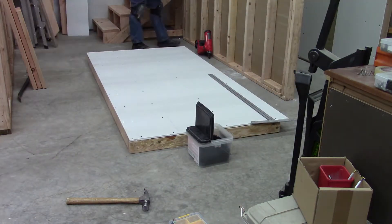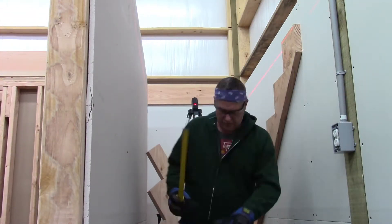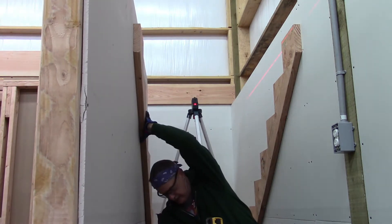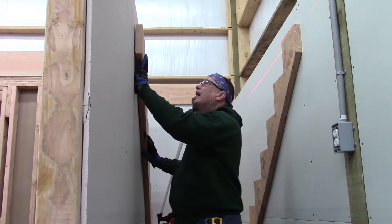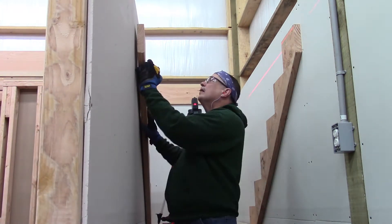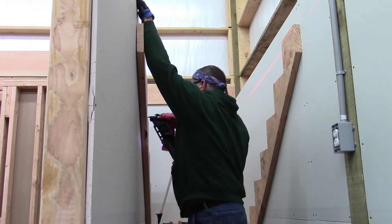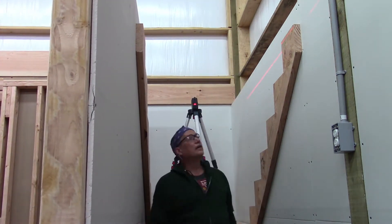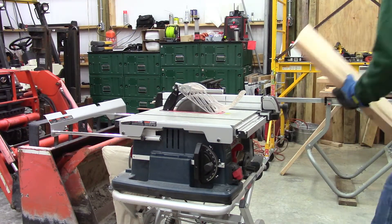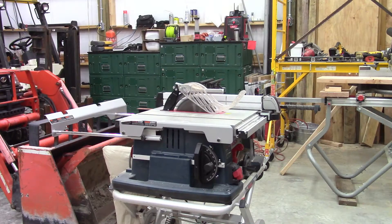After I build the short wall section with the piece of sheetrock hanging off three and a half inches, it'll slip into that space that the scrap of plywood created, and it'll be sheet rocked all the way around on the inside. With sheetrock walls on both sides of where the upper stairwell's going to go, I've already got the stair stringer attached to the outside wall, and now I'm going to use the laser level to get the exact correct height.